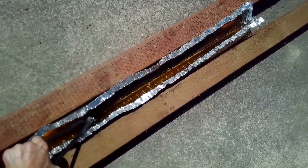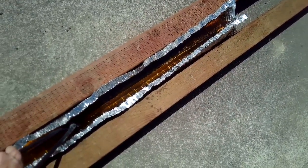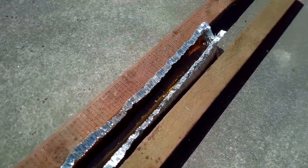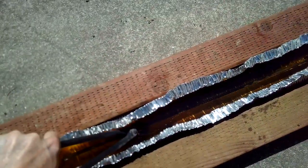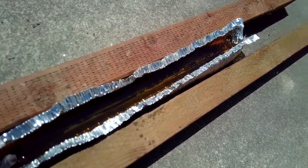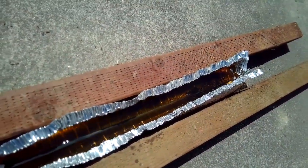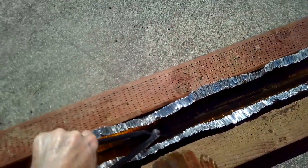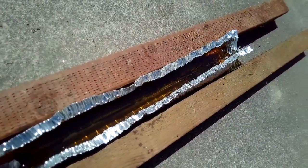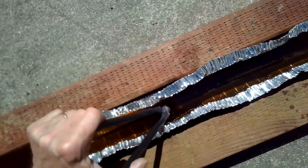Keeping it vertical — nice douse. We used probably one full jug of Wesson oil; it was enough to fully sink the whole sword, which is good. You just want to leave it in there. Once it's nice and cool, get it dried off, take it to the grinder, and put a nice edge and profile on it.